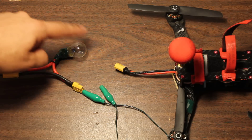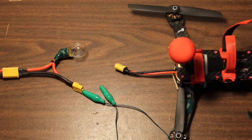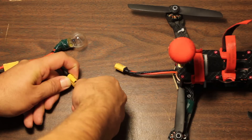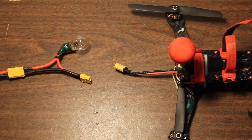How many amps you draw depends on the light bulb. This is actually a two-element bulb and I've hooked up both elements, so it'll allow about two amps. If you were to use a single-element bulb it would draw about an amp and a half. So if you short this, it'll draw about two to two and a half amps, which means that is just the absolute most that could possibly be drawn through this circuit.